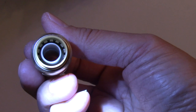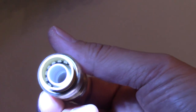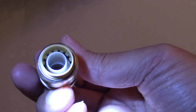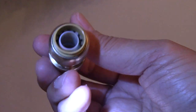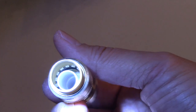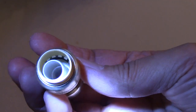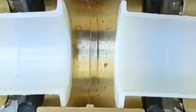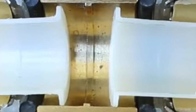Let's take a look inside a shark bite. In the center, that white plastic is the pipe stiffener. Around the pipe stiffener are the teeth — those are made of stainless steel. Around the teeth, that tan color plastic is the release collar, and when depressed with a special tool the shark bite will be released from the pipe it's connected to. Inside is a black o-ring and a gray o-ring to stop water from leaking.